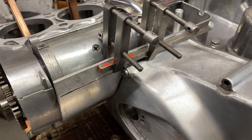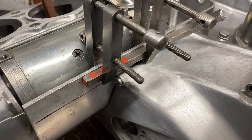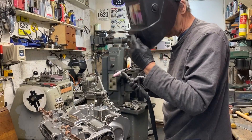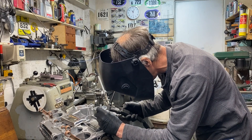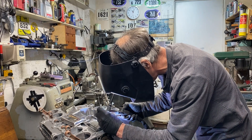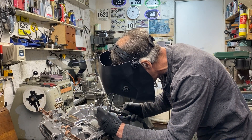With the piece trimmed to size I clamped it to the actual engine casing using a piece of square steel and two clamps. Then I tacked it in place with a couple of TIG welds on the engine with it all bolted up, and then transferred it to my vise to complete the weld.